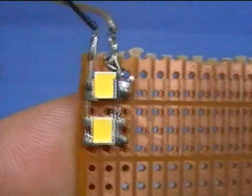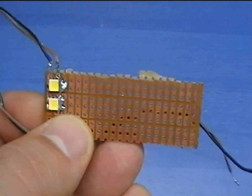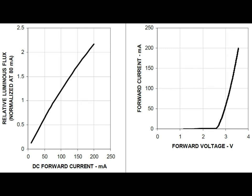As you know, LEDs have a certain forward operation voltage to provide full brightness. Even a few millivolts can change this brightness significantly. The LEDs that I plan to use, for example, operate at 3.4 to 3.6 volts and draw a maximum of 100mA. Check out the current to voltage characteristic of these LEDs — the current, and thus the brightness, drops rapidly to zero if the voltage becomes less than 2.5 volts.